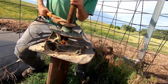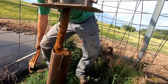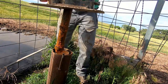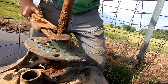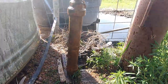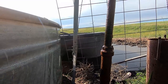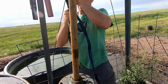Okay, here we go — this is when it gets really hard. This is where you got to be careful; you got to set it down on a pre-planned spot. We got it! That is what is in the bottom of one of these windmills. This right here is called a cylinder. It simply unscrews — there's a plunger in there and another piece that unscrews in there too. Let's get this thing off so I can change the leathers in it.